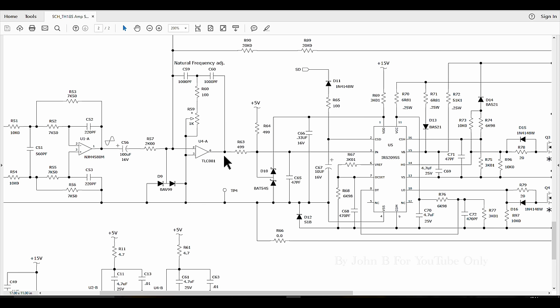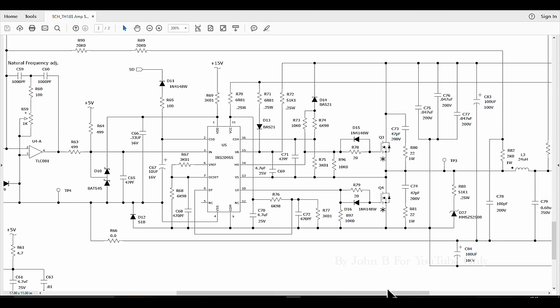High-speed op amp, 10 megahertz high-speed op amp, that's known as an integrator because it integrates the signal with the feedback. So this particular circuit that's running on my amp, just half of it running, it's actually near 500 kilohertz, which is touch fast, but you know, they blew up, took out the chip, or the chip took them out, and all these little capacitors that I spent hours and hours testing, now they're all fine.